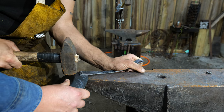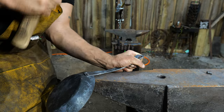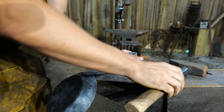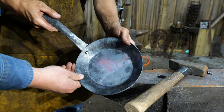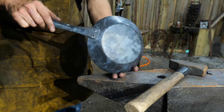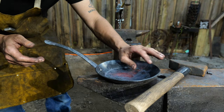Get it up on the anvil surface, press down, go for it. As you can see, that's attached now. You can drill the next hole and put in the final rivet after a little bit of squaring up, making sure that handle is exactly where it needs to be and it's sitting pretty.